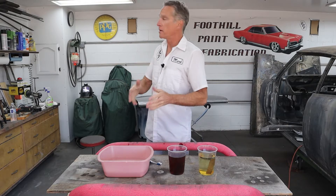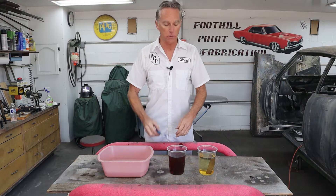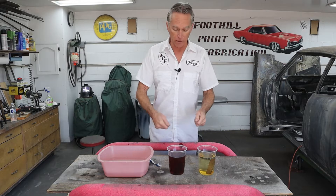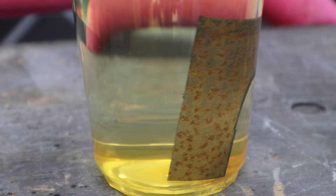Okay, it's been 24 hours — actually 23 and a half hours since we first dropped those rusty pieces of sheet metal in there — and we're getting good results. I can't tell what's going on in the one with molasses because it's so dark, but I've got a tub of water here and an old toothbrush. I haven't agitated them or anything — I dropped them in and set them aside. There is rust: this water started turning rusty color within an hour, and there was a little film that started forming on the bottom. You can clearly see — remember how rusted that piece was? Now only the pit areas are still rusted. So 24 hours — not bad for a homemade brew rust remover. Let's get them out and scrub them and see how they came out.